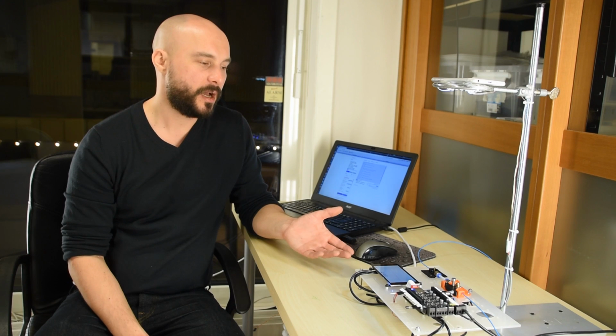On the second level, you can use it to add an alarm in case the filament starts to deviate fast. Then you know that either there's a clog, or there's a jam, or it's out of filament basically. And so you can use that to stop the print and then have an operator intervene.